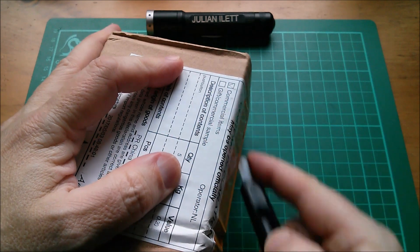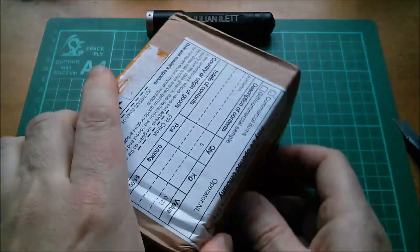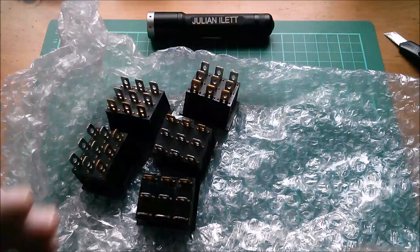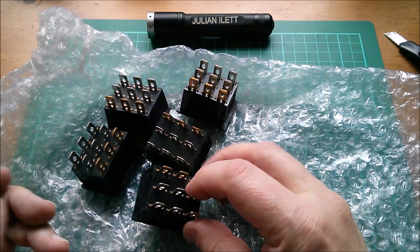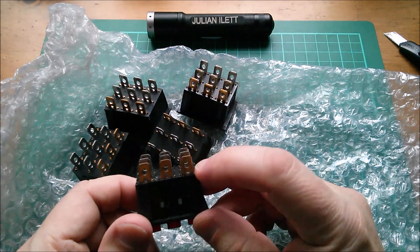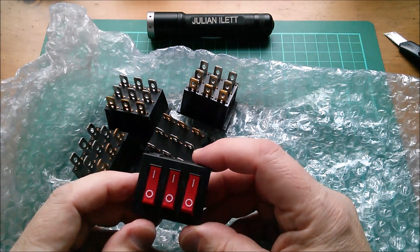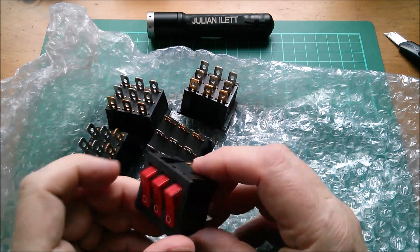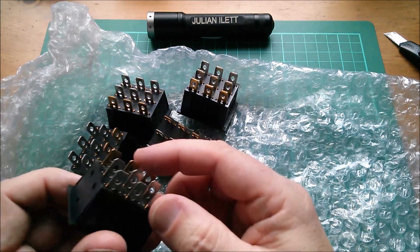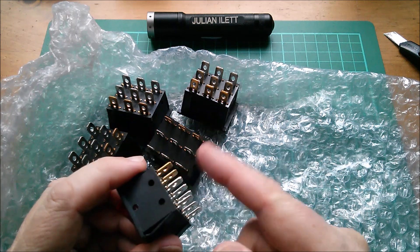Let's take a look at this next one - it says push button, quantity five. Let me cut that open neatly because I reuse these boxes for storage. These are actually switches, with a lot of connections on the back - they're three switches in one block. I presume they're totally independent in terms of wiring. I have a feeling there's also a lamp in here, possibly 12 volts. The lamp may be at this brass-colored connector at the top, making the switch just an SPST single pole single throw.